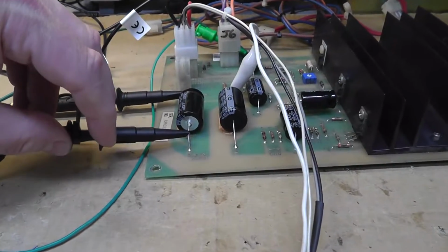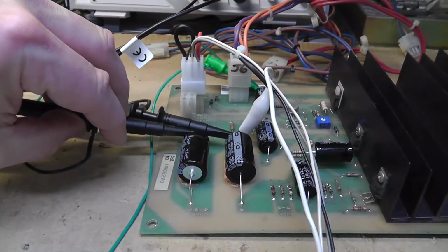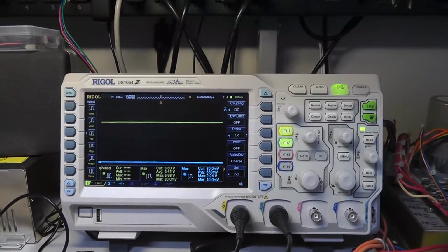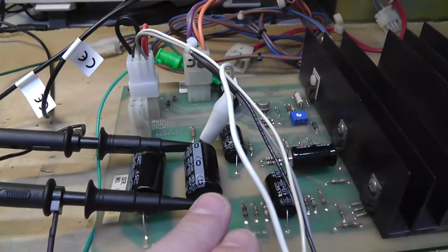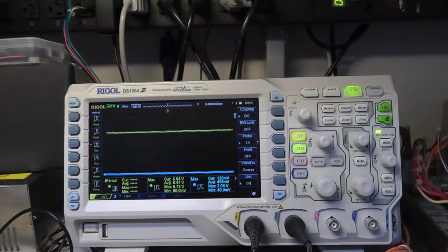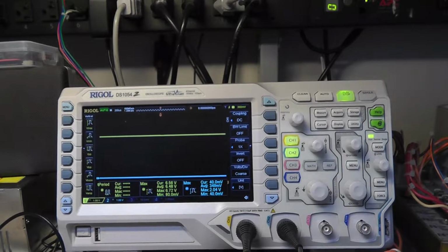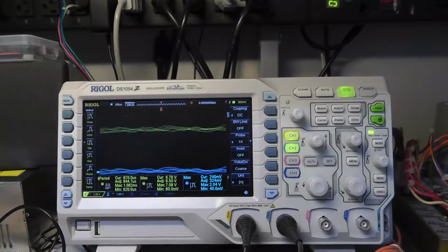Alright, let's switch them around. So my channel 2 comes up here. Now I'm wondering if having the speaker actually hooked up is part of the voltage measurement difference. Yeah, see, now it says 6.6 volts going in to capacitor number 2 and around 80 millivolts depending on the signal, obviously. And this is DC coming out. And you go all the way down to 0 signal, you got 40 millivolts, 6.5 and 40 millivolts with the speaker hooked up. Right there.